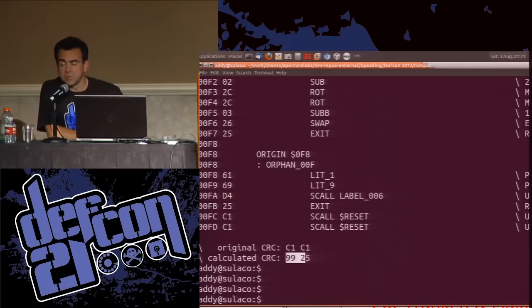One of the other things we really wanted was to be able to run the code and see what this thing's doing. We've read the EEPROM, so we know the data that's gone in, but we don't know what it's doing with it. So we could sit and try to manually step through this, or we could write an IDA Pro plugin or something cool like that. Again, the development kit would have had an emulator in it. $25,000, we're not going to buy that. I did find a copy of the software for the dev kit. It was in German and it was on a Russianware site, so we decided to give that one a miss. So yeah, Python is your friend.